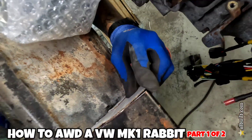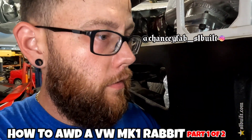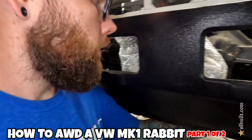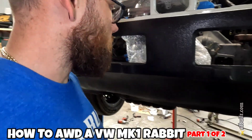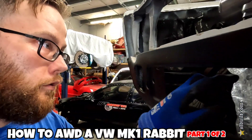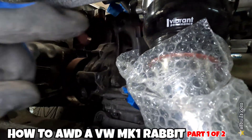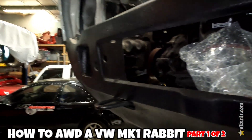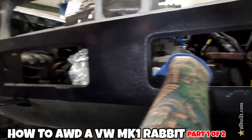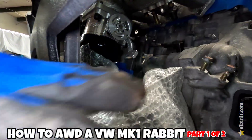Making the plate and getting everything boxed up nice — closing off all this so it's secured and has more strength since right now it's a bit flimsy. We've got a four-inch-to-three-inch reducer from Vibrant and then a Vibrant charge pipe — a 120-degree three-inch tube — which gives us enough angle to get it back over to that side so we can build the rest of the charge pipe.